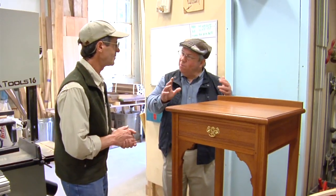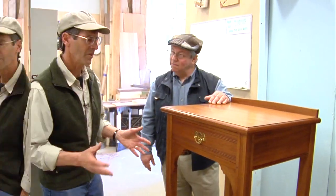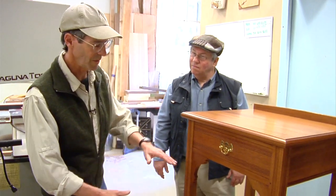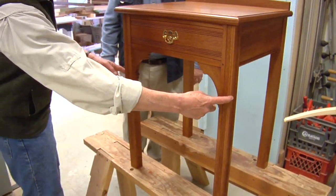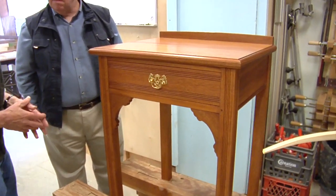It's a ratio and it's a whole number. If you know one measurement, that's all you need. All I needed to know was the height — in this case about 27 inches. That's my only measured parameter; everything else is a ratio. On this piece it's a two-to-three ratio — what would have been called a square-and-a-third piece of furniture: a square here plus a third of a square built on top to create the rectangle.